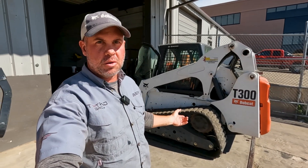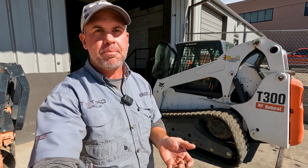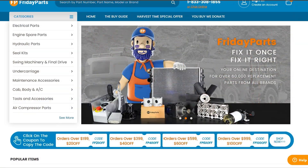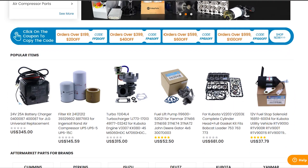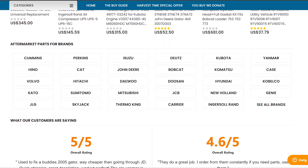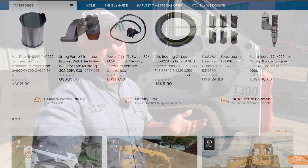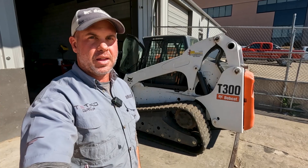This T300 now runs like a brand new machine — that's exactly how it's supposed to operate, no resistance in those sticks. It's odd how it happened — drive issues, replaced the pump, it didn't help. The reman pump, which we're going to tear down in the very next video, had issues with how it was rebuilt — mixing parts — but we won't mention who rebuilt it since it's a reputable company. The brand new Bobcat pump from Friday Parts fixed it. Thanks to Friday Parts for supporting us and helping with this video — they didn't give us the pump but did help with getting it to us. For hard-to-find parts, check out Friday Parts. Now we're just going to finish cleaning up and putting this machine back together.